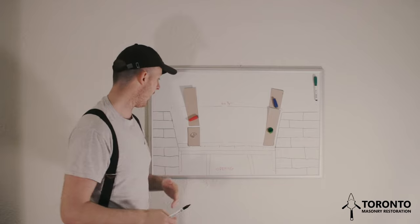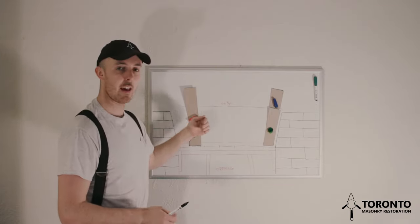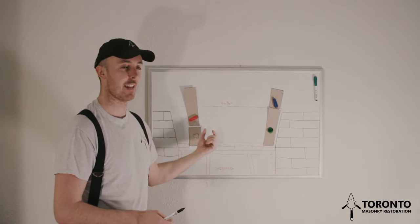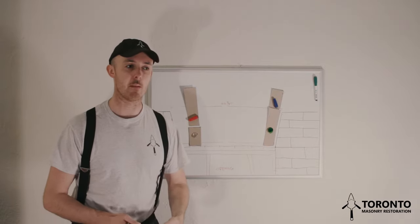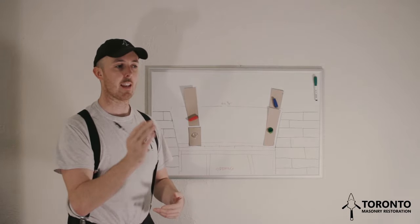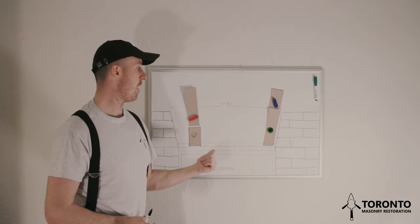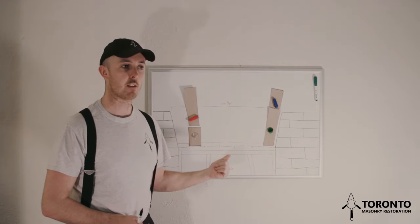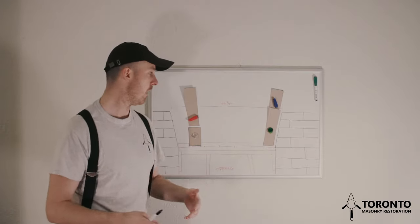And the same can be said if you lay your brick a little bit ahead of the mark: you can take a 16th off the next course or an 8th off the next course and still have an aesthetically pleasing arch. But if you pre-cut all your voussoirs, you have to then lay them perfectly, which isn't difficult, but with this method of laying a jack arch, you can hit the ground running. You don't need to clear out the space to cut your voussoirs.